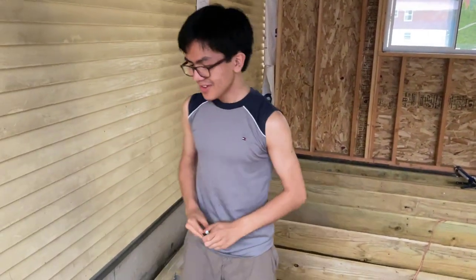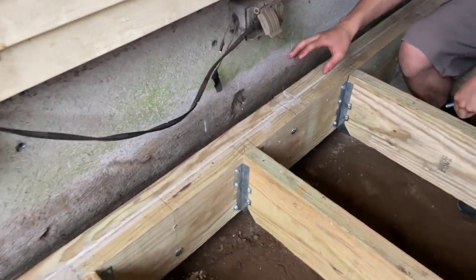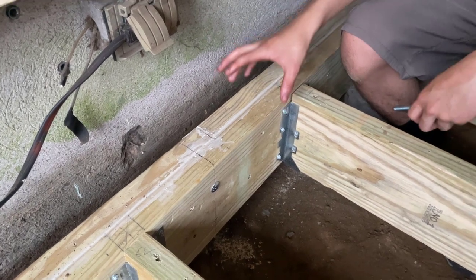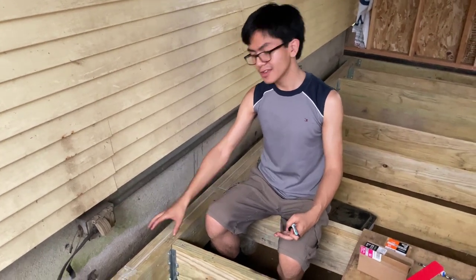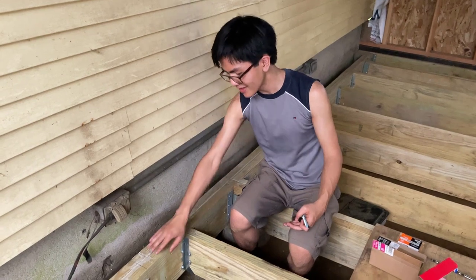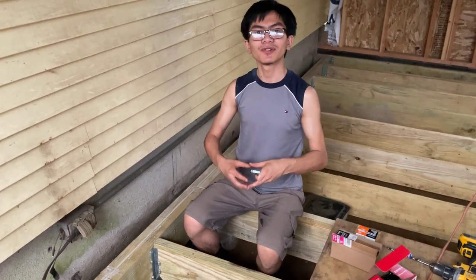So let's talk about the job we're doing here. As you can see, these two beams are right next to each other and combined with each other. This combining is referred to as sistering or doubling the joists. In this case, this is called a flush beam — it's meant to be flush with this other beam and provide additional strength.